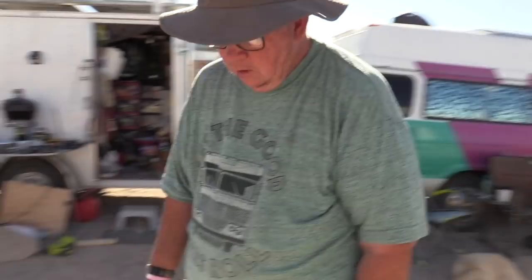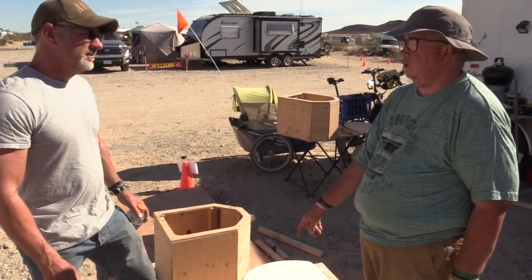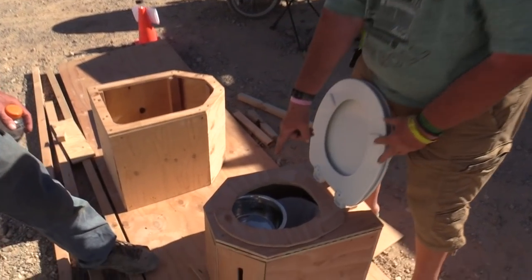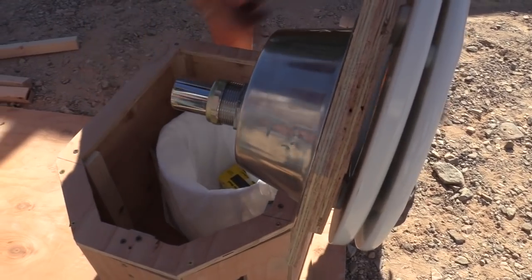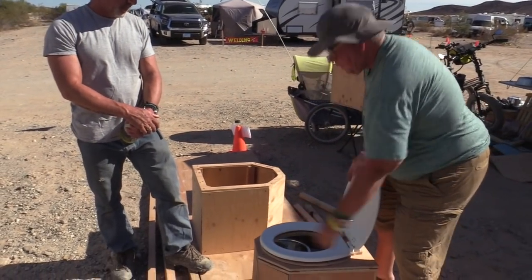This is the actual composting station at the van build. We saw Dan over making the box for it in carpentry, but this is where it gets finished out. She's got a couple of them in the final phases. We're cutting these out and manufacturing them here — we've done this from start to finish. We've got a couple different models: the taller model like for a handicap, and the shorter model for just standard, and then this is the squatty potty model for a client who wanted a real short one. We've put in a urine diverter, it has a two-gallon bucket, and when you lift it up you can get your bucket out and your jug out. It's all locked in so it's not going to move. We've got openings so you can see what you've got in your jug, and all you've got to do is sit — you don't have to lean forward or lean back. We put a riser in there so you don't feel anything. It's like sitting on your commode at home.